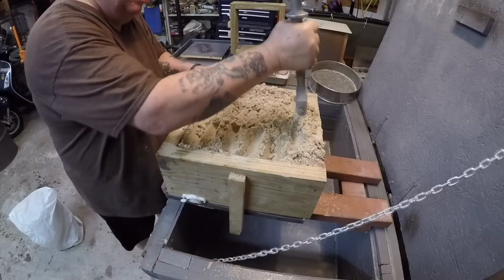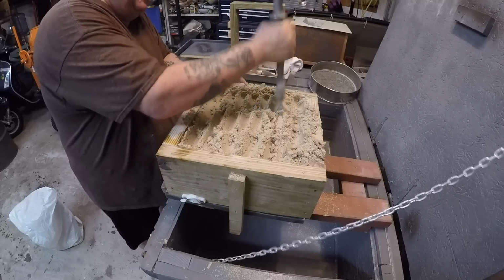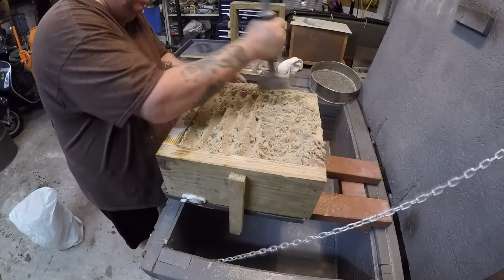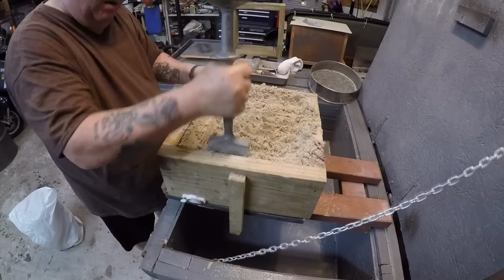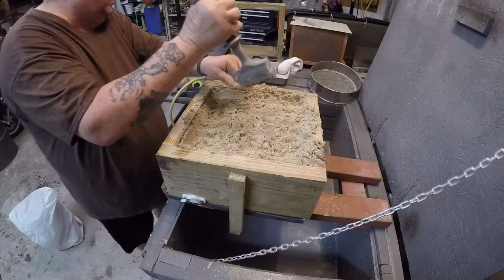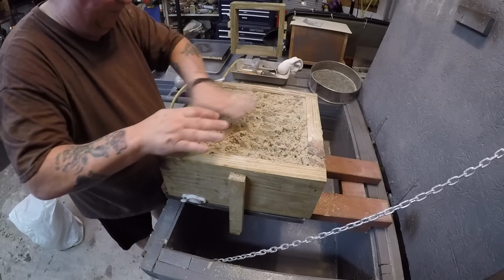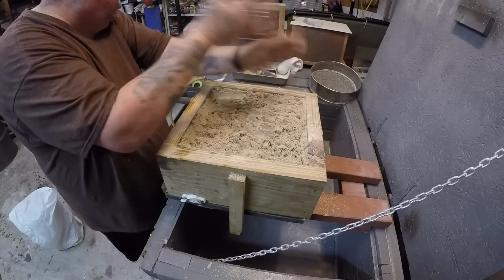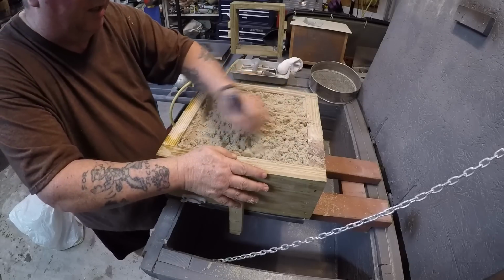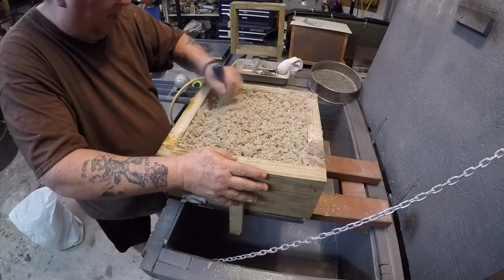Because in these circumstances, unless you're in a foundry and you can use testing equipment that cost thousands or hundreds of dollars, when you're replacing the clay, you're going to have to do it bit by bit and make a judgment call each time you stop mulling it and see if its molding strength is good enough for what you're making.